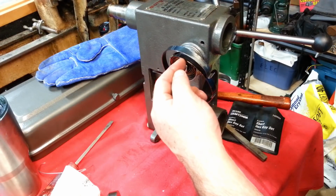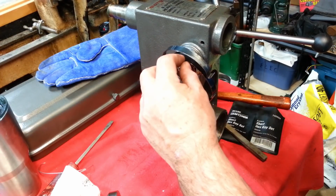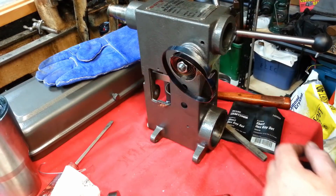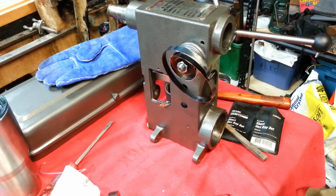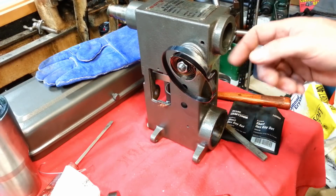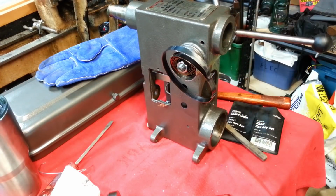I should consider cutting this off and put on a little kick-around bend in another location in order to catch the tab inside. I'm worried that if I cut that off and bend it, it'll crack where I bend it. It's pretty hard stuff. But wow, it's not going to take much tension on that to return the quill. I think I better think on this overnight.